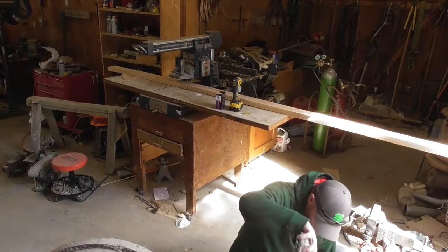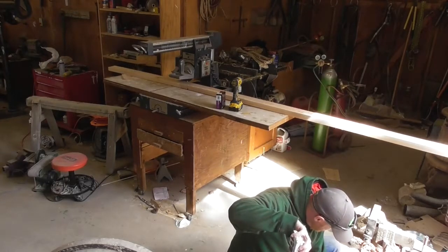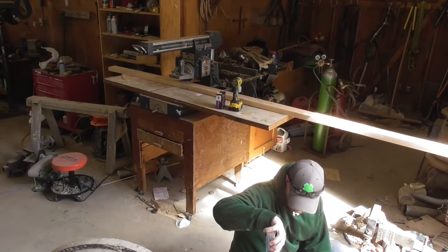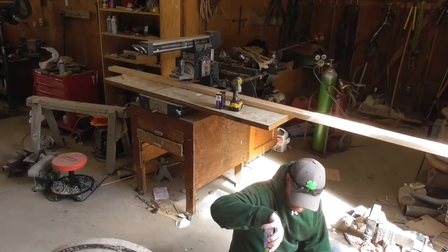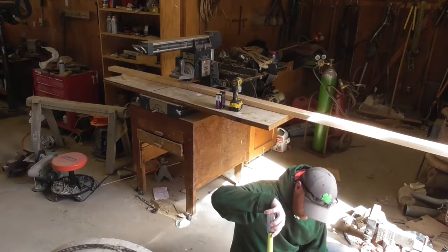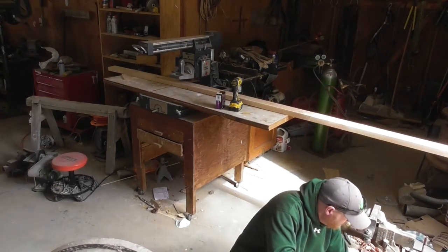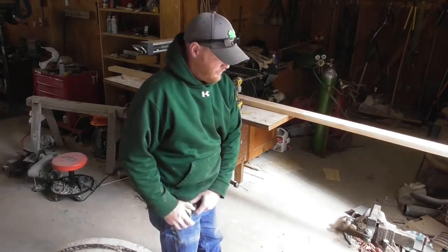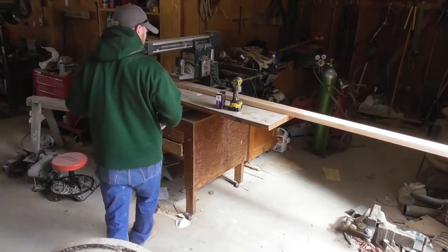So since we take it on the inside, the box in the end is 3 feet, outside to outside, 3 feet one and a half inch. Inside is 34 and three quarter inches. That should be the same all the way around. But when we put the shelf in, I'll do two of them at 34 and three quarter, and then I'll get my measurements for the other two sides.